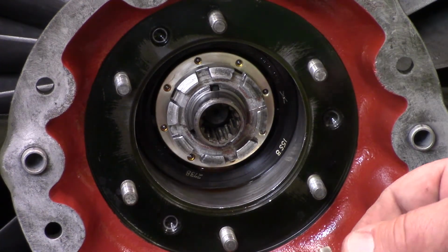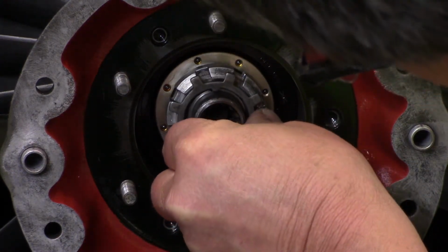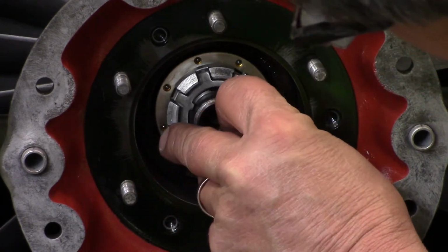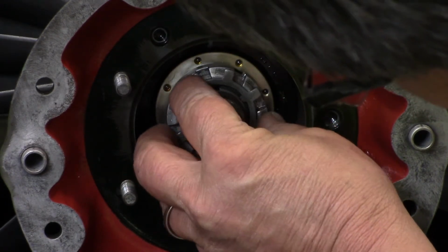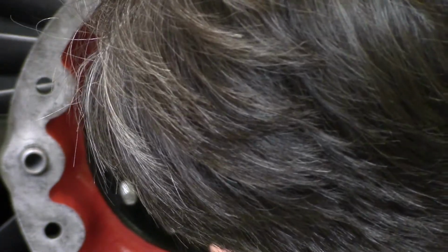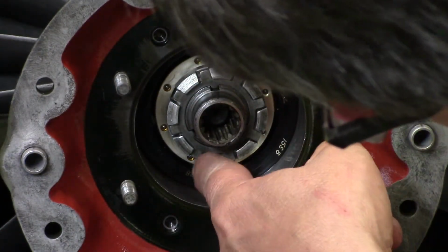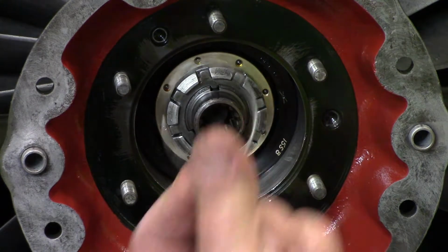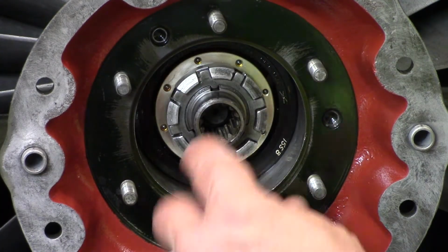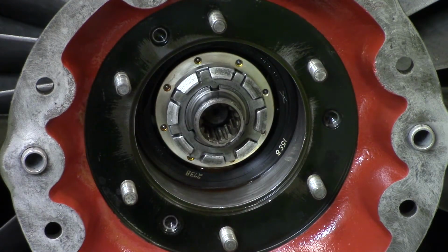Here's our lock nut, here's our spanner nut, and here's our locking ring. What we have to do is turn this until you get the right combination of the three inner and the many outer tabs, and there it is, all lined up and dropping in place. You see we have one, two, three tabs that engage with slots machined in the shaft, and the outer tabs drop into this spanner nut. Now we can install our little lock ring here, which holds that together, and the nut can no longer back loose or turn. It's held in place. Plus it's very tight.